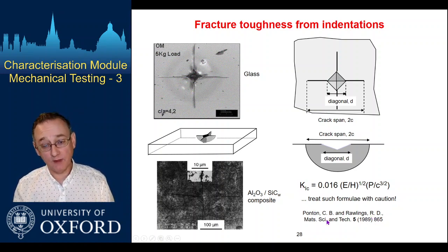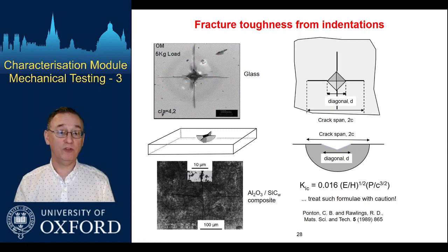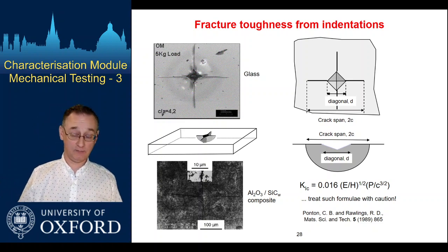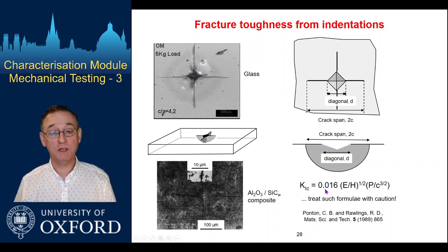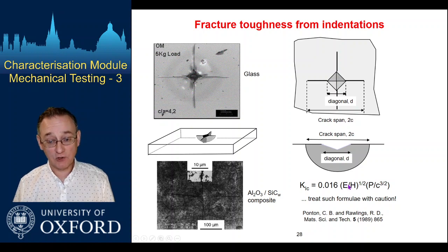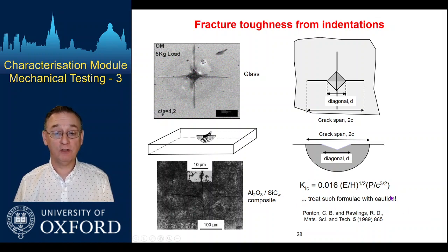One problem with this is that the constant out front is shown as a constant but actually varies to some extent from system to system. For borosilicate glass it might be rather different from alumina, and different again from zirconia — they're all roughly this sort of value but they do vary. If you're comparing a set of aluminas with slightly different sintering agents, this would work absolutely fine and the number would stay reasonably constant. But as you change systems, the E over H ratio varies a bit and frictional forces on the surfaces also vary a little, so some caution is needed — it's good for comparing similar ceramics, but if you jump between quite different systems, the comparison is less soundly based.